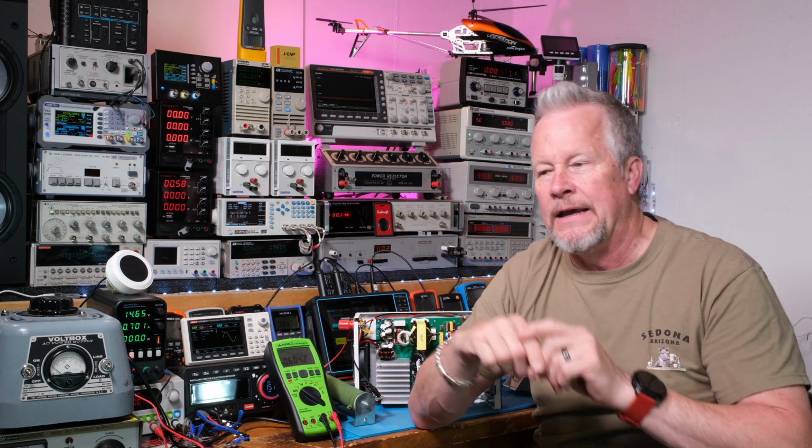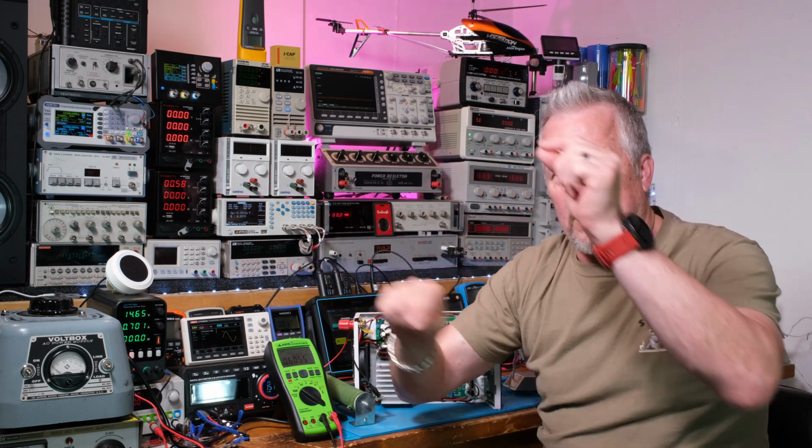Now, I'm not really showing them off very much, because in both cameras you can add dots, lines, or boxes. With the dot, where you put the little X's, it'll just tell you the temperature in those places. In the line case, it'll go up and down the line trying to find the hottest or the coldest thing on that line. And on the box, it'll run around the box and tell you the hottest and coldest thing in that box, which I think is super cool. The combinations of those things are really neat.